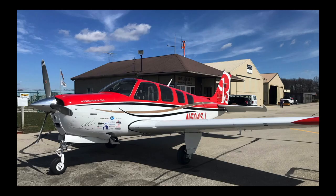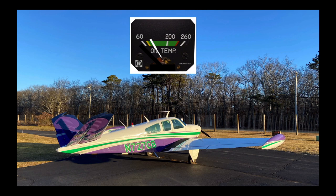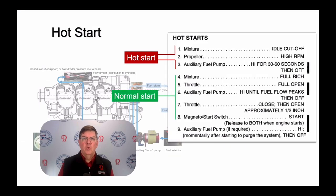When do you need to perform a hot start? If you've shut down just long enough to discharge or board passengers, you probably will be able to start right back up without fuel circulation. If the airplane sits for more than a few minutes after flight, however, it may need a hot start for several hours, even in relatively cold weather. There's nothing definitive, but unless you've preheated the engine, if the oil temperature is in the green arc when you turn on the battery master switch before start, you probably need to do a hot start. If you try a hot start when you don't need to, you won't make the eventual start any more difficult. All you will do is delay your start by 60 seconds while you circulate fuel, then perform a normal start. So there's no hazard if you misdiagnose the need for a hot start procedure.